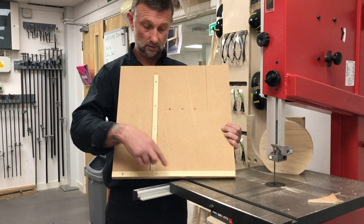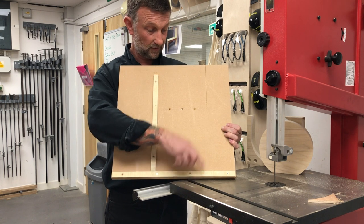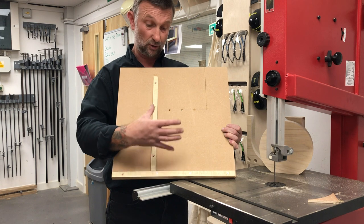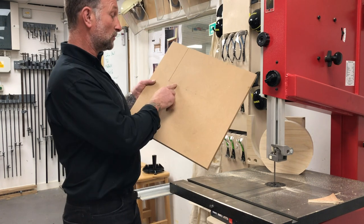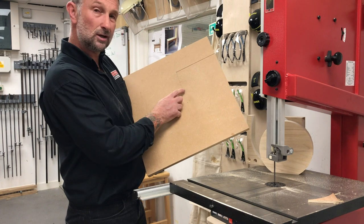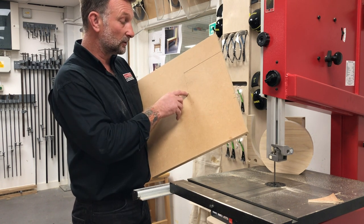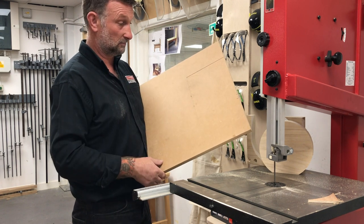stop plate, or a stop bar, a little piece that runs in the mitre fence slot. Slide on through, this will take you to your stop, square off from that, and whatever hole spacing that you want to create and cut the circles that you want. Then you can mark them up from the top so you know the dimensions, simple screw through, and it's important just to get that screw just poking through. If you get too much screw coming through, your material starts to pick up on the screw thread. That's okay. What you can do is just file down the tip so it's not a screw thread anymore. It's almost like a nail point.